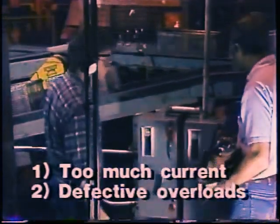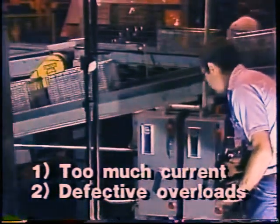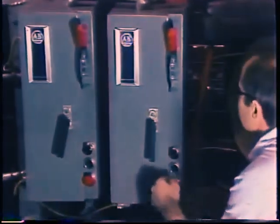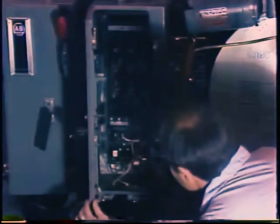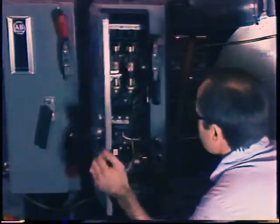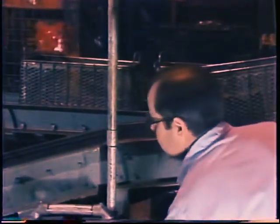To eliminate one or the other, you'll have to try restarting the motor. When you do, you'll have a useful opportunity to investigate the symptoms further, analyze them, and perhaps save yourself some time in trouble. Make sure the machine is off and reset the overload breaker. Then, once you're sure it's safe, try to start the machine and be ready to observe closely.